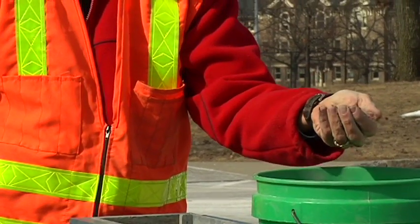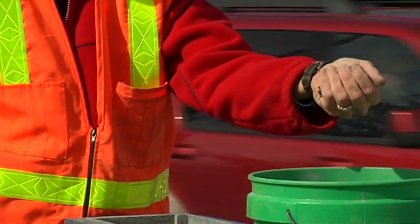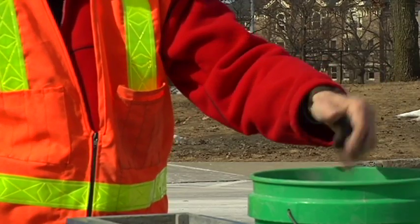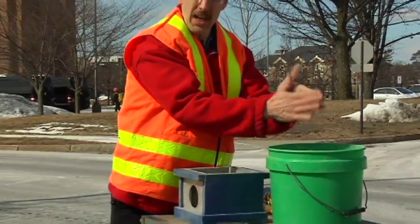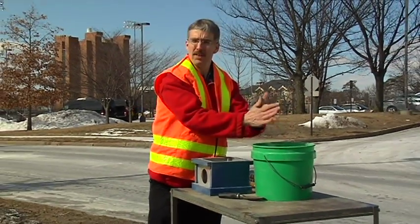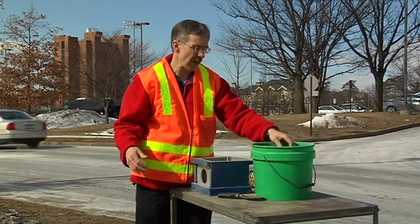So now we've added some water to it, and we squeeze, and as you can see it's just starting to hold a cast, and there's not water coming off on my hands. So that's pretty good. We could test for this in the lab, and there are tests that we recommend people do, but at the minimum you should at least give the gravel a little bit of a squeeze.